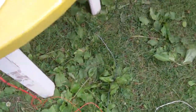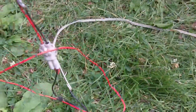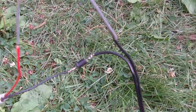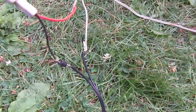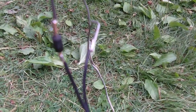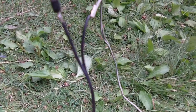For wiring, I've used old automotive weather-sealed plugs from cars. I have many wiring harnesses around, so I cut off these plugs and solder them into a harness. This harness still needs to be taped up — I just soldered it the other day. I've also put a diode in. You have to have a diode on the panels; if not, it'll drain your batteries at night. Wire the diode so that the negative from your panel is connected to the side with the little silver line.